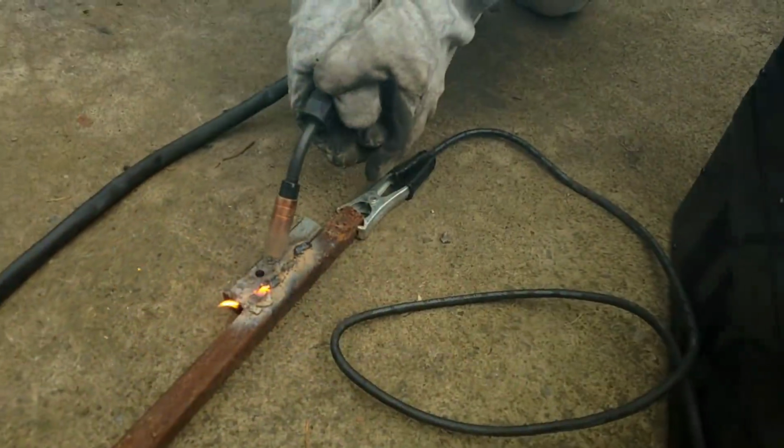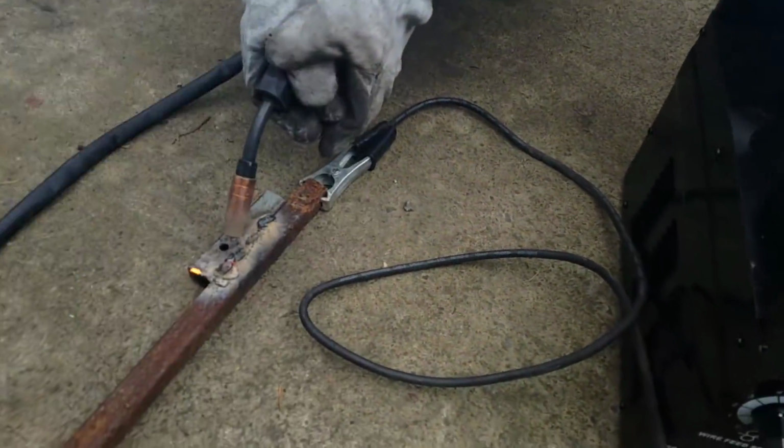Go in circles, about the size of a dime. Well, half a dime, whatever. Go in circles, don't stay in one spot. You have to stir it. You have to melt the two left and rights together. It's like solder, but better. Hey, that is slowly. Circles in the same spot while moving slowly back. It's like you're constantly drawing the cursive letter E.